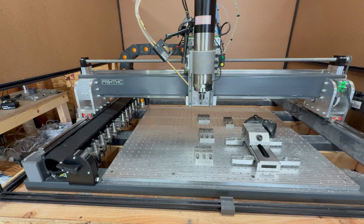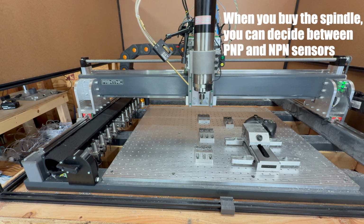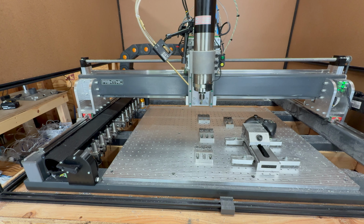One thing I forgot to mention, this spindle has two integrated sensors. One sensor checks whether a tool is installed properly, and the other sensor checks whether the drawbar is activated or not. And I use these sensors in my macro. During all the different steps in such a procedure, I double check whether the drawbar is activated when it has to be activated, whether a tool has successfully dropped or loaded. Because just imagine when you forgot to turn the compressor on and you want to load a tool but the drawbar isn't activated, then there's a huge risk that you end up with a damaged spindle or tool rack, or worst case, both.